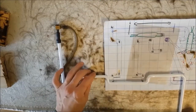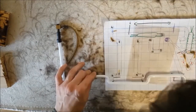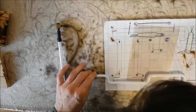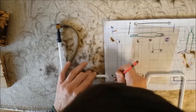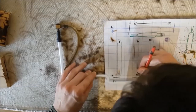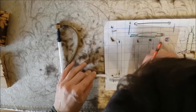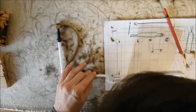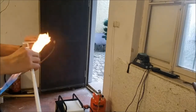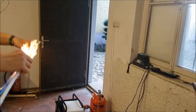Now I'm doing the first of the skipped bends from that roof of the letter L. So I'm centering the tube above those two skipped bends and marking them. Some preheat, because the previous bends are pretty close to the next one.